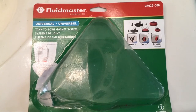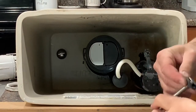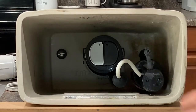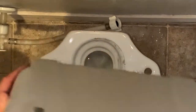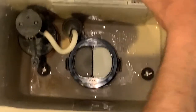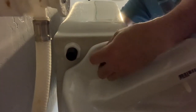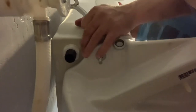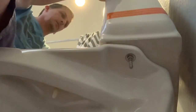I did end up buying a tank to bowl gasket kit and it was universal for all kinds of different toilets, and I didn't have any issues with this kit. I put the sealing washers on the new bolts and set those in place. The bottom sealing ring was different depending on the style of toilet — the instructions on the back of the universal kit tell you which one to use. I put that on the bottom of the flush valve and set the tank in place, then put the washers and nuts on both bolts and tightened those down by hand. The whole time I was wiggling the tank to make sure it was centered on the bowl. Then using a wrench I slowly tightened those nuts down, still wiggling the tank, and stopped as soon as the tank felt firm — if you over-tighten there is a chance you could crack the porcelain tank.